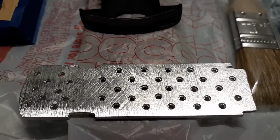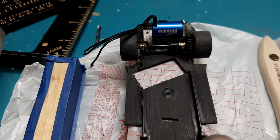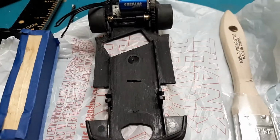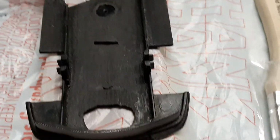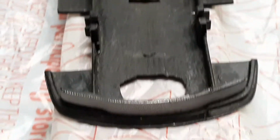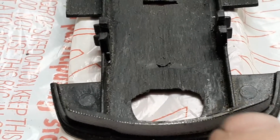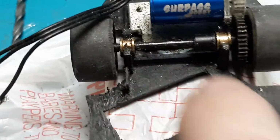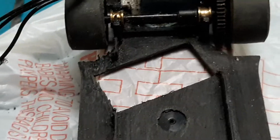Alright, I prepared my aluminum plate to be glued to my ABS chassis there. I've roughed up the chassis with some 80 grit sandpaper right there. It's not perfect, but it's nicely scratched up. And I think I'm still going to use a minimum of 2 fasteners up front and probably one there and one there just to make sure everything gets bonded correctly.